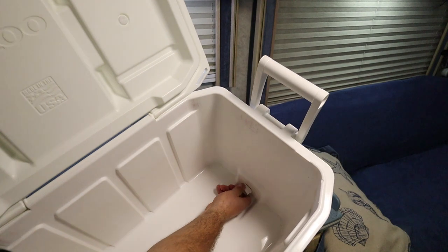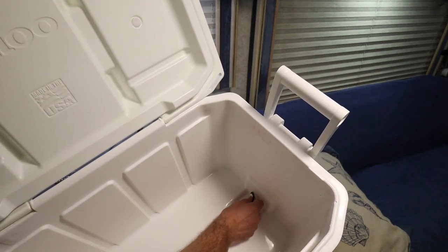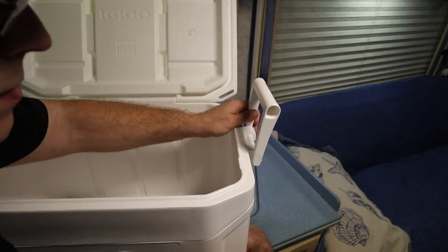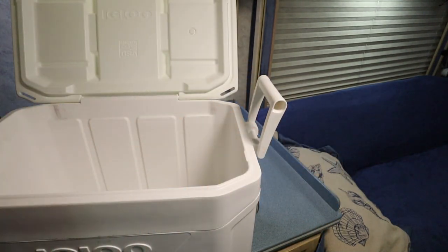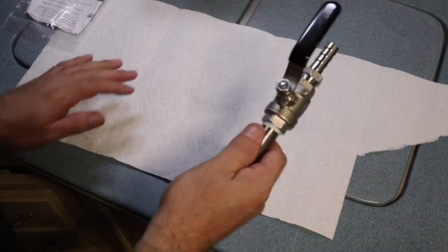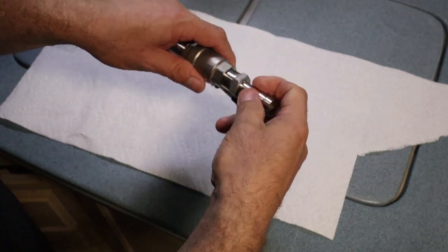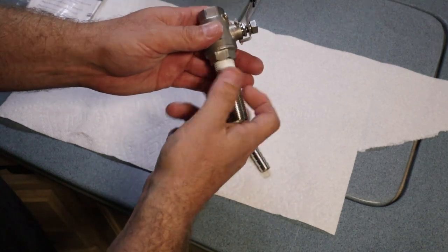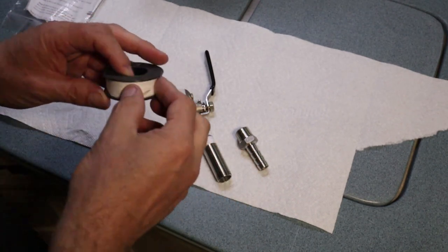You can see there's just a giant nut in here — we'll unscrew that, pop it off, pop off the seal. There are just those pieces. We'll grab the old drain out and keep the pieces just in case this doesn't work out. The valve doesn't come assembled; the parts are just sitting in the bag. So we need to take it apart. They did wrap a little Teflon tape around it, but not a whole bunch, so we want to add some more Teflon tape.